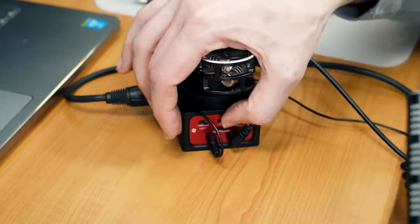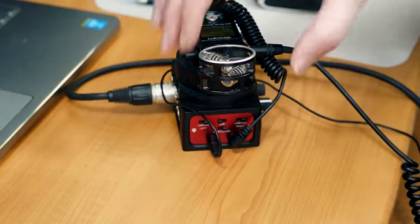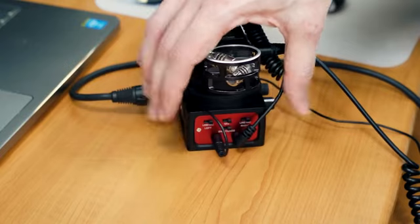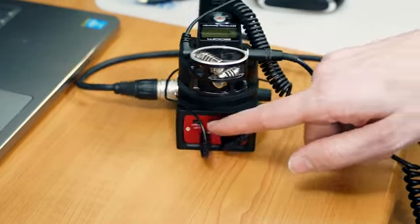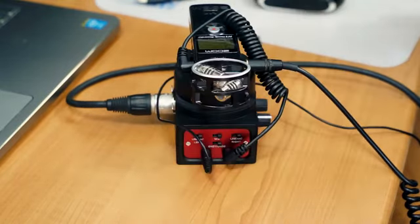If I hit the mono switch, you'll now put both microphones in mono mode. They'll be mixed to both channels, but for our purposes we're going to leave them both in stereo. Notice both microphones are in the microphone setting in both channels, not the line setting. The ground loop switch right there isn't doing anything in either position because there are no ground loop issues.